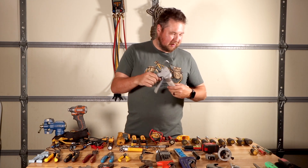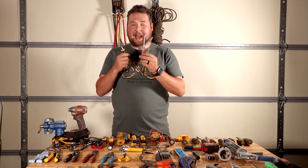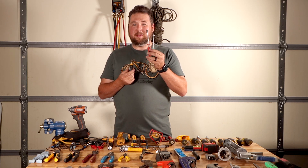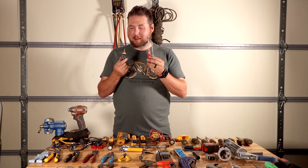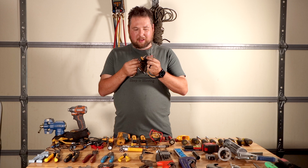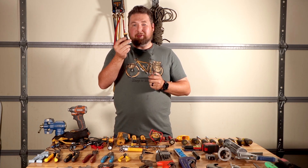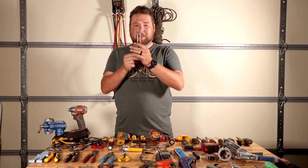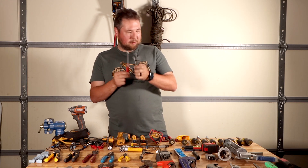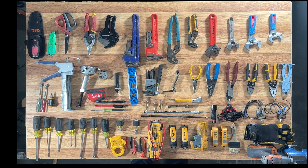Some people say these aren't required, but I highly suggest these tools for taking off refrigerant locking clamps or locking caps. There are different types — this is the no-vent cap tool, and this one is for the Shield locking caps. One is for R-410A and one is for R-22 slash universal. Those are definitely important to have.